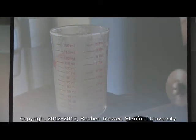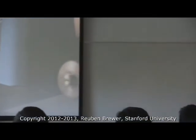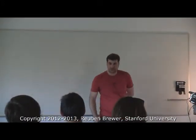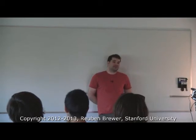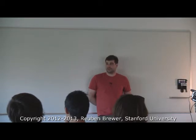If you read about them, some claim there's a difference between dial and digital. I always just look at the precision of the instrument. As long as the precision has what I want, I go digital because I hate reading little dial gauges. Also, dial gauges typically only measure in one unit system — either inches or millimeters — but digital usually has a button that converts between the two, which is important since a lot of machinists work in inches and a lot of parts are in millimeters.